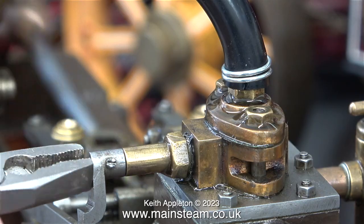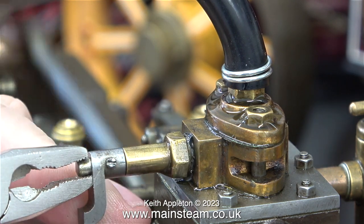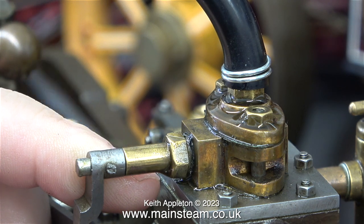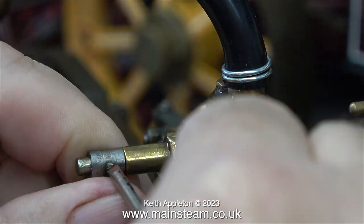This is on top of the steam chest - in this case compressed air is admitted to the engine. When I first got this engine I disabled the governor by changing the position of the shaft inside the valve, because for the application I required, the governor was unnecessary.